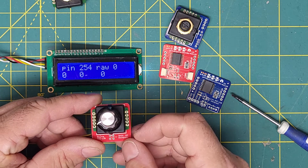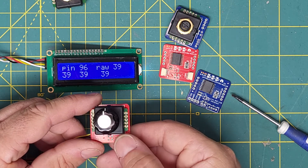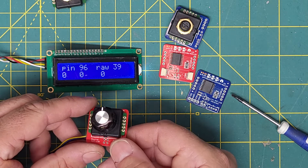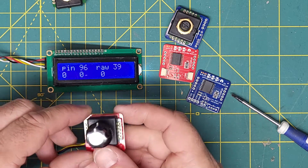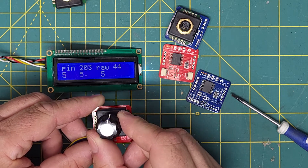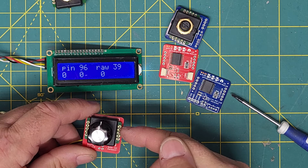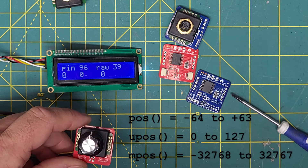You'll notice on my knob, I want zero to be at the top, but zero is not currently at the top. So what we do is move this to the top where we want our zero to be, and then there's a button we can press which resets the logical zero used for our output — putting an offset in the software. So now my zero is at the top. If I restart the Arduino and reset it, it still knows that zero is at the top, at position 39. The 96 on the screen is the actual binary value that comes out of the physical device, and 39 is what comes out of the lookup table.